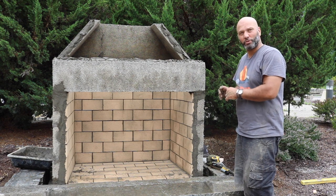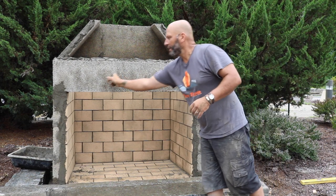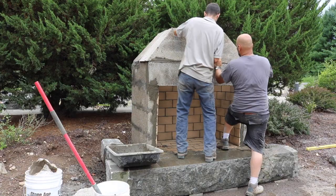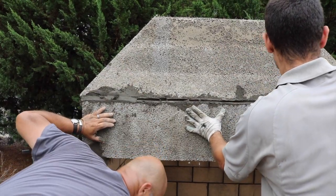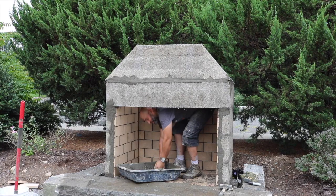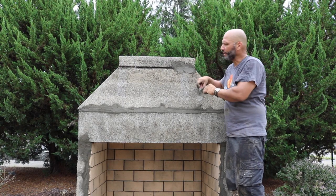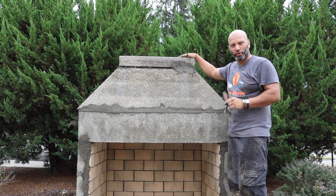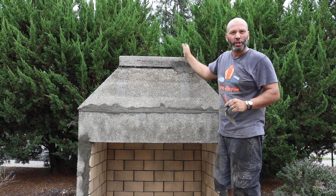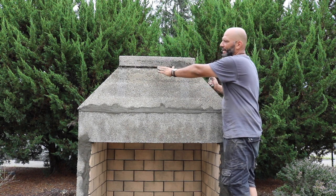We've installed the straight lintel, which measures eleven and a quarter inches, and it's now ready to receive the throat that goes on top. The lintel also comes in an arch, which we can show in a future video. I did the same half-inch joint on top of my throat section. Next is the reducer, which is only part of the 48-inch contractor unit. What the reducer does is reduce the size of the chimney extension. Once you've placed each component on top, go around and work your mortar in on the outside of the joint and also on the inside.